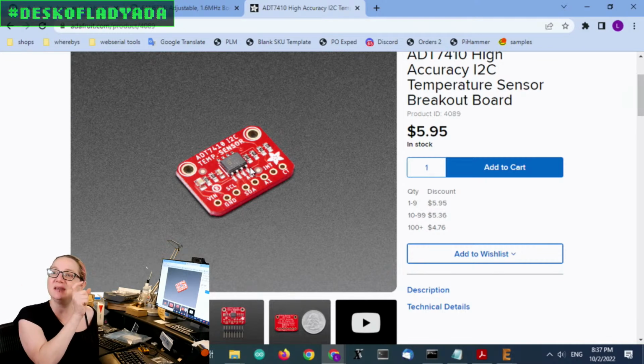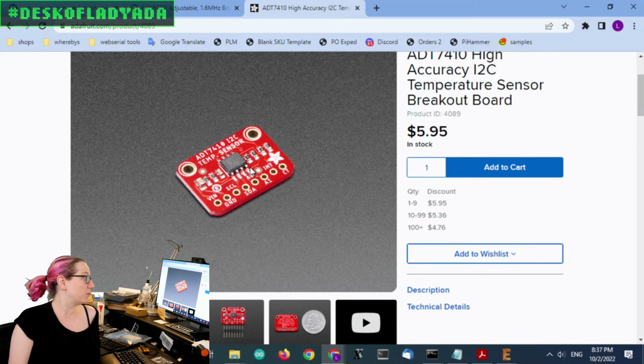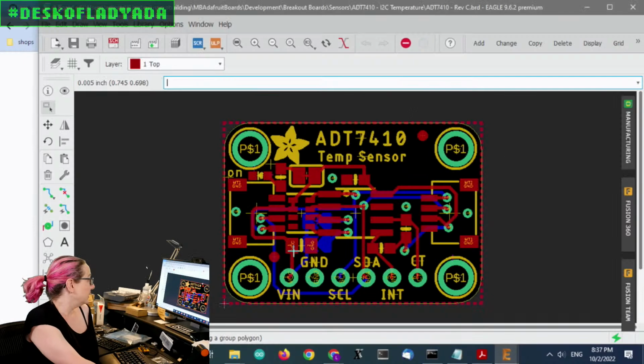It was just like, you can see it's got that same shape and size, but it didn't quite make it to have the JST SH connector. So we're going to revise this one as well because this chip is in stock. So when we sell through, we'll stock the stemma QT version. Just trying to get everything into the same format, same pin order, same connectors, just for cross compatibility, no soldering support. So that's the ADT.